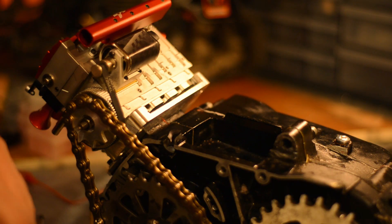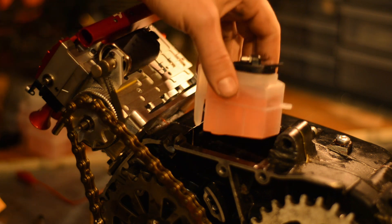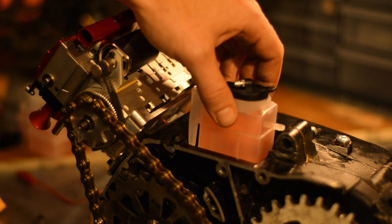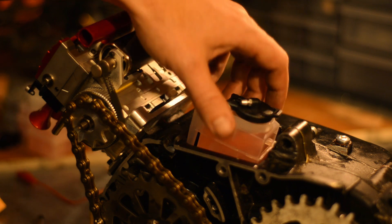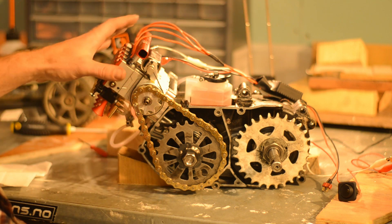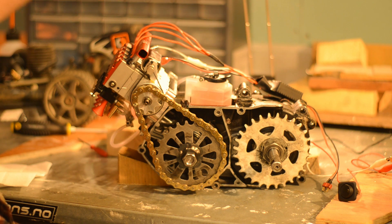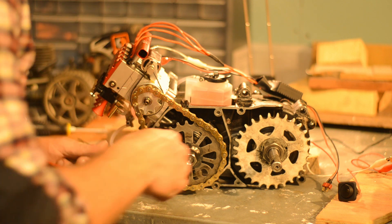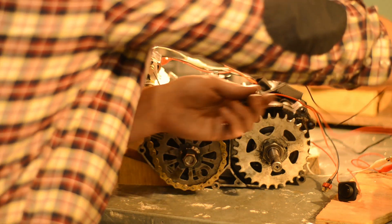This recess meant for the carburetor is a perfect match for a tiny fuel tank. Now, this won't get you far. If this works and is usable, I will switch this out for a float chamber — just like a carb but without the carb parts, just a float chamber — and use a bigger fuel tank to feed it. Second test: can it turn the whole gearbox assembly under its own power? There's no point in putting this in the moped frame if it can't even turn the engine. I haven't got the water hooked up, so just a short test to see how it behaves.